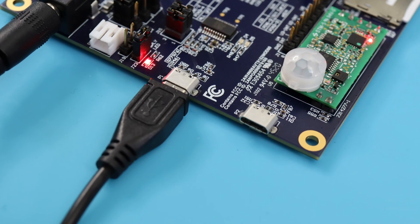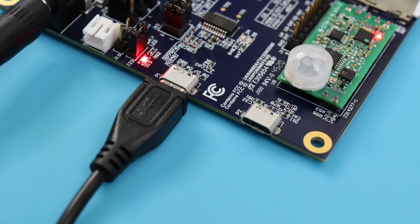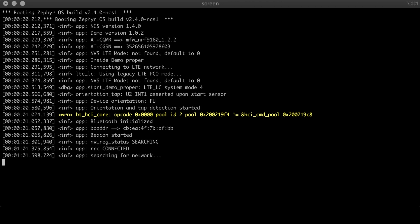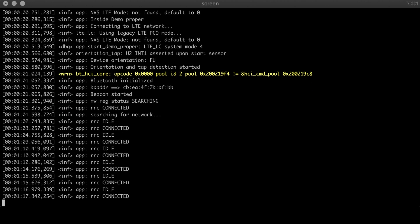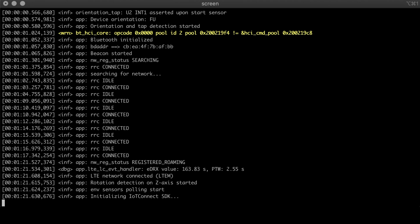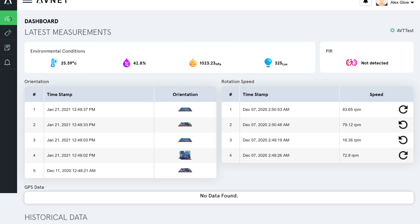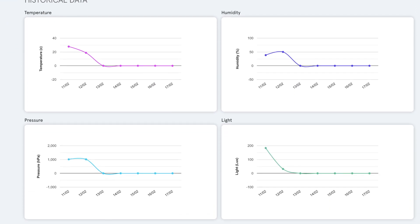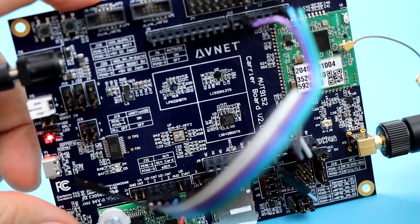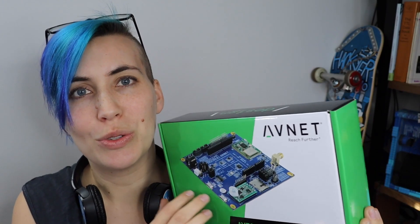While we wait for that to come up, I'm going to connect the device to my computer using the micro USB cable. This will provide a virtual COM port interface to send data to and from the terminal. I'm now able to see the application version, modem firmware version, and the IMEI on startup. The settings for connecting over the virtual COM port are also in the quick start guide. As you can see in the online dashboard, the board now says that it's connected and will be reporting sensor data over time. I've enjoyed getting to know this little kit, and I think that you will too. Check out the links in the description below for the AVT9152 evaluation kit, and be sure to share with us what you build.